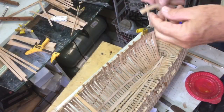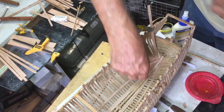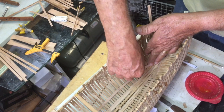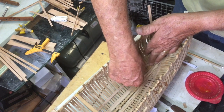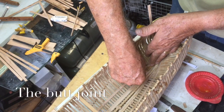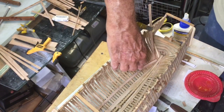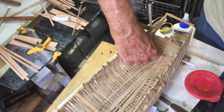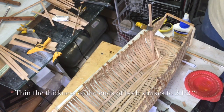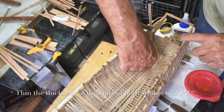Now we can do our trial fit. The only thing we have to be careful of is the cut here to join it up — it's not going to be at 90 degrees, it's going to be at an angle. So we make sure we get that angle correct. Once you take your time, remember you have to take this end down to two and a half inches, and we've got a perfect curve. It's relaxed and all we have to do is push it down flat.